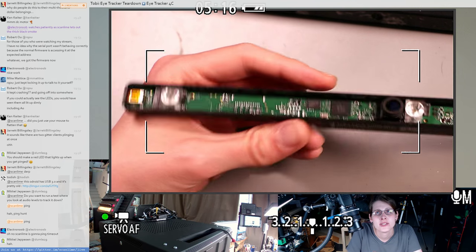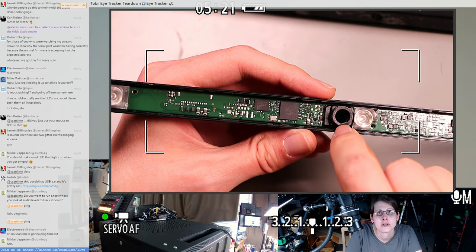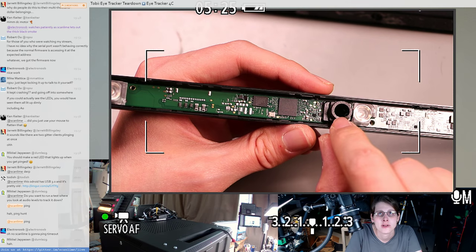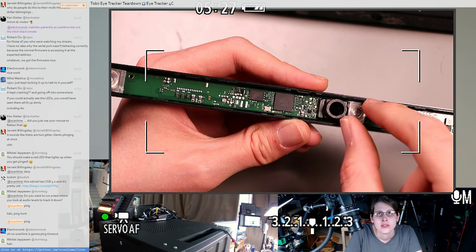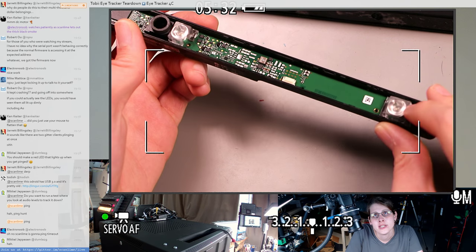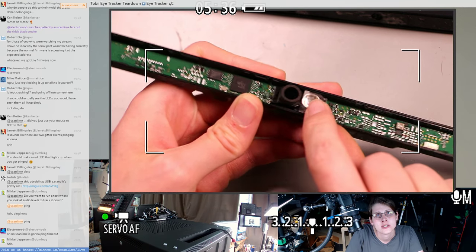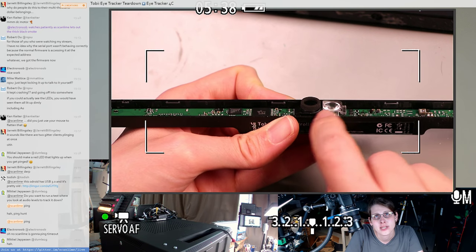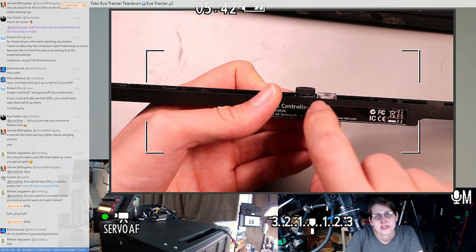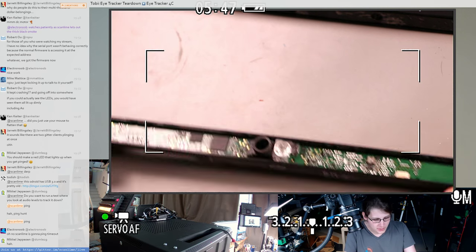So in the IX, you can see a camera, which I'm assuming is just an off-the-shelf image sensor with this baffle and infrared filter on top of it. Then these are infrared LEDs plus a cluster of four visible LEDs under a lens. And you can see in the middle one, it looks like they want to co-locate these two, but really that's as close as they're getting. And then over here, they want some spacing.